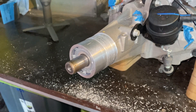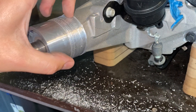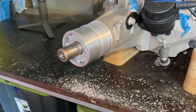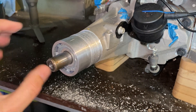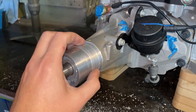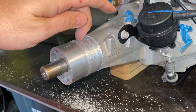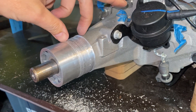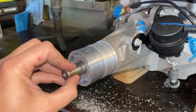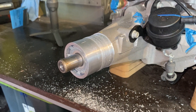Alright, I'm not gonna lie — that took me probably about an hour of turning this by hand to get it down to there. It is a little chattery as you can see, but I guess that's the nature of using a 3D printed part to do something like this. It was getting a bit of deflection as I was putting a load on it and spinning it, but it did the job. We've skimmed that down — it's not quite level but it's pretty close — and we've got a good inch there that it's come back. We can now make the boss to go on the front and then make a pulley that sits over it so it lines up with the crank.